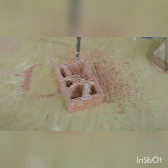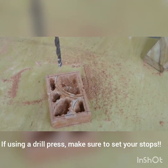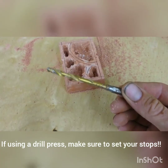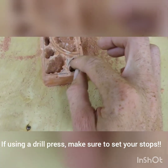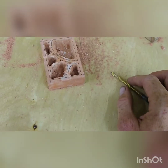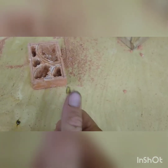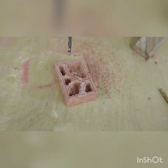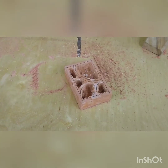I use a drill press — in my opinion far and away the easiest way to do it. I have a normal cheap masonry bit on there — not a normal drill bit, a masonry bit. I do a bunch of plunge cuts around the outline of each chamber, then I can just crack off the middle part. Then I take a normal drill bit and basically use it like an end mill to go in and clean up all the marks from the drill bit. The reason I use the masonry bit first is because a regular bit would dull out in about a minute drilling through this masonry material. A carbide bit would last way longer but that's like eighty dollars — this was like five bucks.